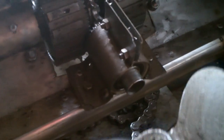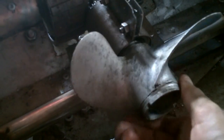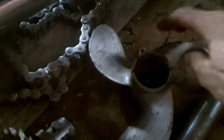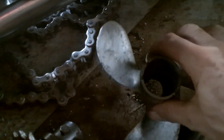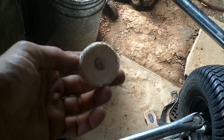I'm going to get this to fit. This back here is the same diameter as the propeller shaft — I just hand filed this to get it to fit because it was pretty close. Now for this other end, I think I'm going to make a plastic insert on the lathe. Good thing I keep my hole saw leavings.